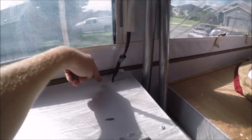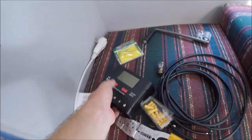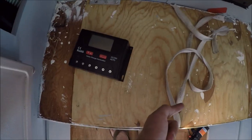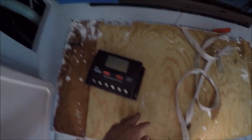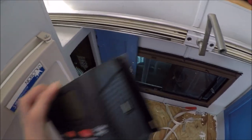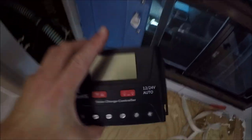I'm going to drill a hole, the wires will go through there behind the refrigerator and into the cabinet where I'm going to mount the charge controller. It's going to be in the worst spot because I won't be able to read it without a flashlight, but there's really nowhere else to put it without wires going everywhere — there's gonna be four wires total going to it. Two going in and two coming out going to the battery underneath the bench. It's going to be tricky. I might actually use 3M double-sided tape to mount it against the side of the camper once the wires are hooked up.